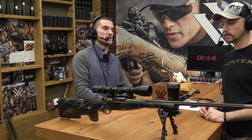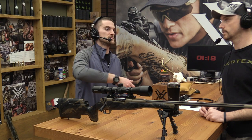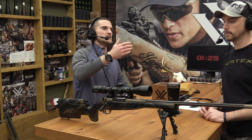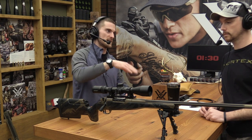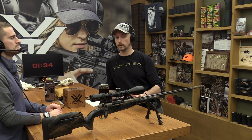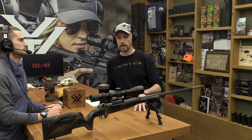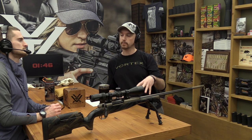Yeah. So if you try to go for a 100 yard zero, for example, you would have to dial the reticle physically up or down on the turrets, and this is where it gets difficult to explain. You would have to dial so much elevation just to get zeroed at 100 yards because of that cant you've put in. We get that call quite often, and it usually is with a 20 MOA base. Most shooters report, I'm 4 to 6 inches high at 100 yards and I've run out of elevation. And the first question we ask is, do you have a 20 MOA base on the gun? And if the answer is yes, well, that's where that's coming from.